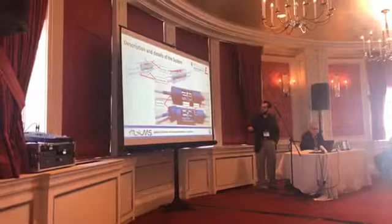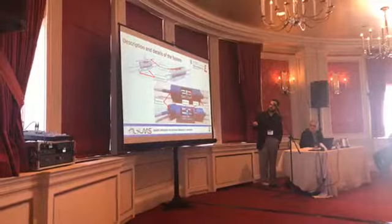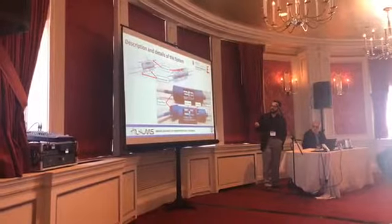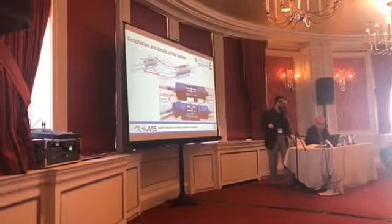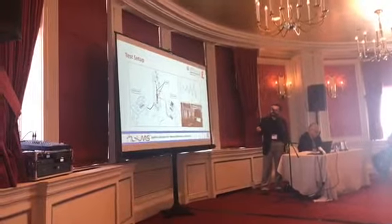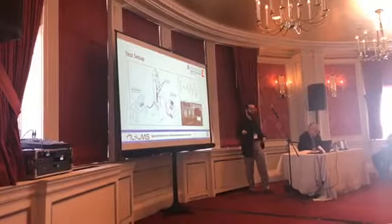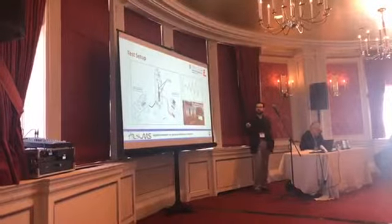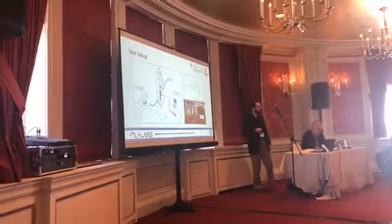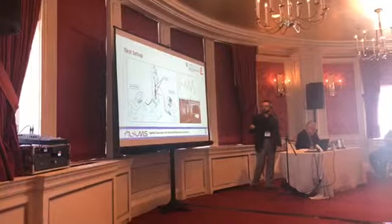So these figures just show a bit of details about the different components. As I mentioned, the SMA bars are employed inside the system with the restraining nuts and the different plates, and this middle plate is the one that actually is moving under the test environment. The figure here shows the test setup that was actually employed. The universal testing machine was used to apply different types of loading, starting from simple quasi-static loading, trying different loadings and different rates, and then ended up also applying some dynamic loadings with a strain and load effect.